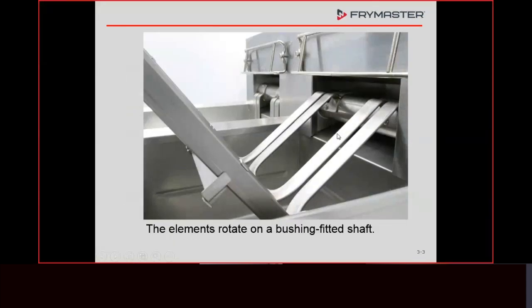Whenever these elements are mounted on here, this tube is not thick enough to thread, so we couldn't just put bolts in here and weld a nut in the back — that would leave no play whatsoever. So if these things didn't perfectly line up, which they should since they're all made the same, it's nice to have a little give. A nut and bolt, or a screw in this case, makes it more forgiving to line that stuff up.